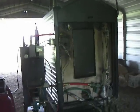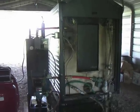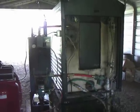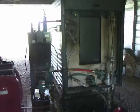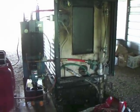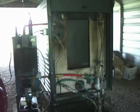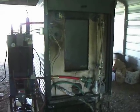Here's my heating system for the upcoming winter. I got a wood burner on the right and a boiler on the left that I mounted a Babington ball burner style burner in. I used some of the housing and some of the electronics off of a Beckett oil gun. Between the two I should be able to keep the place plenty warm — the wood burner's 500,000 BTU and the oil burner's about 100,000 BTU.